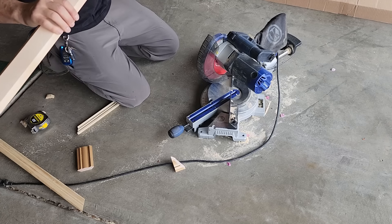I don't want to stand on the counter, but I'm going to have to — hopefully it won't break or crack. That's the only way to get around this bit. I'm just working these last two angles, this outside 45 corner. This is probably the tightest thing I've seen. Here's a little tip: when you're cutting, everything is supposed to be exact — very, very precise. But if you come up a little short, it's not that big of a deal. This whole room is getting painted and caulked in. I am maybe a 64th long, maybe a 32nd. So I'm going to take a half a blade off of this and then this piece will be perfect.